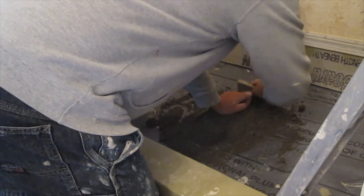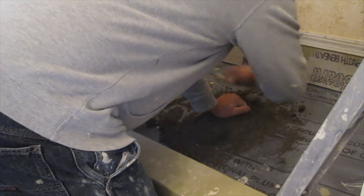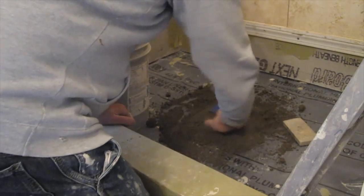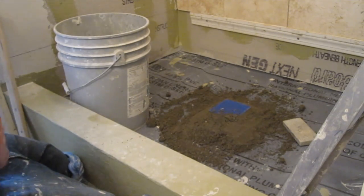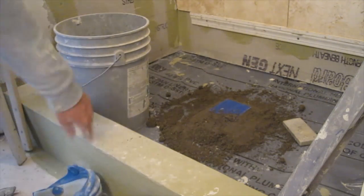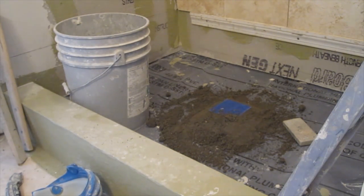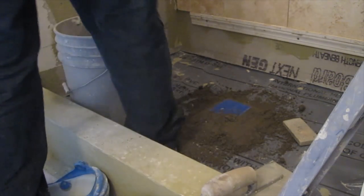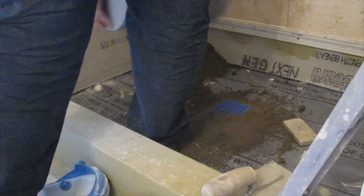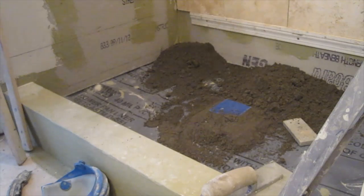I'm packing some mud into that area on top of the pebbles so that they stay in place and I don't have to worry about kicking them out. I have a line around the perimeter of my Durock there, which is not a level line — it's just an indication of more or less where the height of the mud has to go. The mud in these shower pans needs a pitch of about one-quarter inch per foot. It can be more, but it shouldn't be less. If you make it too much more, it's going to be uncomfortable to stand on.